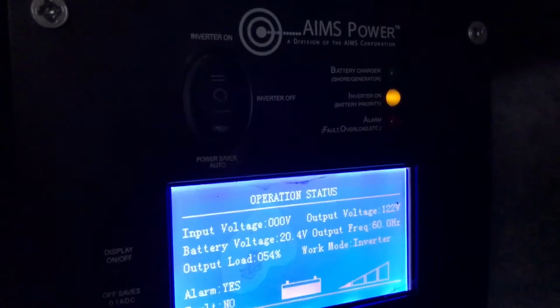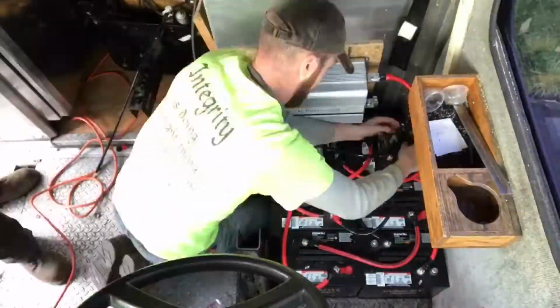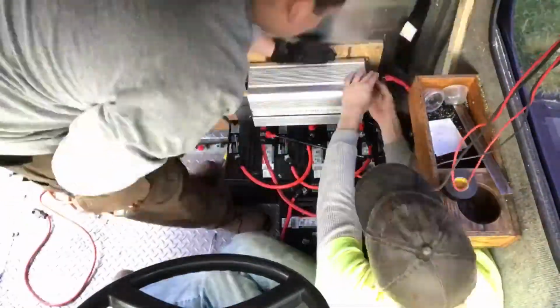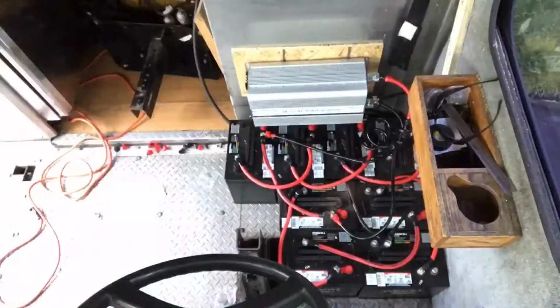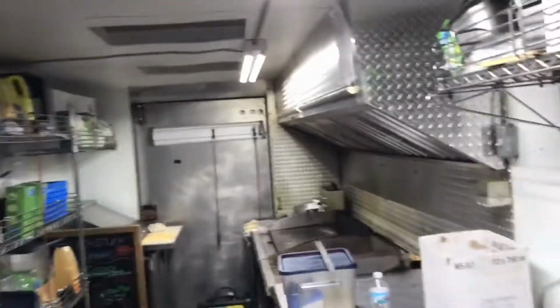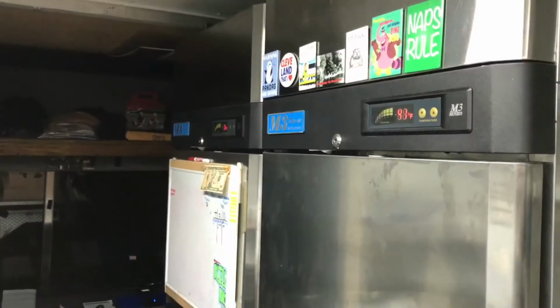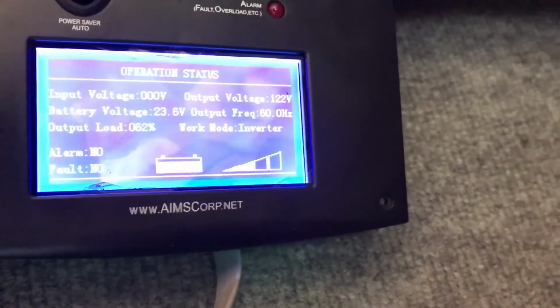It took us a while to figure out what was going on, but these premature shutdowns are being caused by the large initial power draw to start our refrigeration equipment. One of the largest limitations to the technology of lead-acid batteries is that they can only be charged or discharged at a certain rate. If you go over that rate of discharge, say by pulling a lot of amps to start a commercial freezer, then the voltage of the battery bank will appear to drop dramatically.